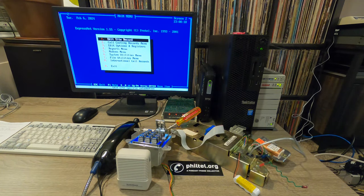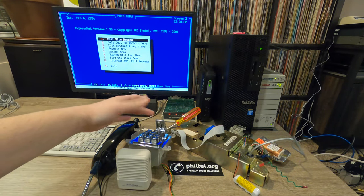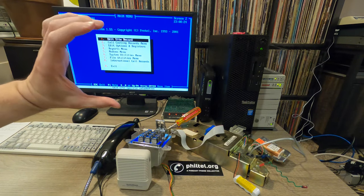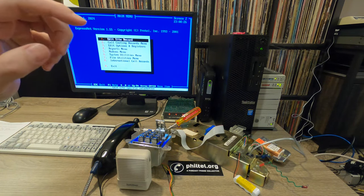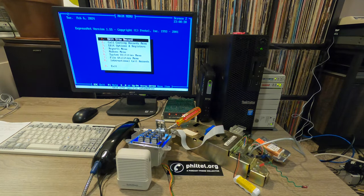And you're probably asking, what is going on with the screwdriver here? So normally when this is mounted, this keypad with hooks, which is mounted vertically, you have a cradle at the top, sort of like a cup that the handset goes into. And that pushes down the hook switch. So I'm basically just pushing that down with the screwdriver so that the phone isn't always off hook. So that's just a little hack to keep that down.